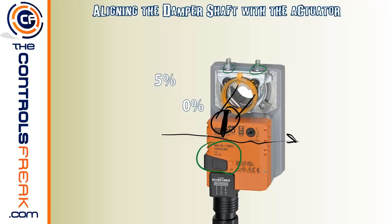Now this actuator is going to be mounted, and there'll be like a little screw here that's going to nail that sucker down. And the actuator body is not going to move, but this turning buckle here with the U-bolt is going to turn. And what we're going to try to do is make this go to 0% shut by using that clutch. It's going to free spin. So we'll make it go to zero. Now this is all assuming you have no power on the actuator and there's no control system in place.